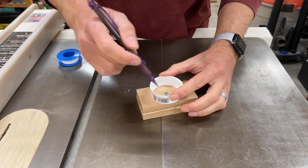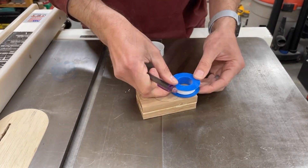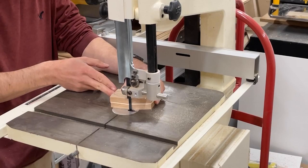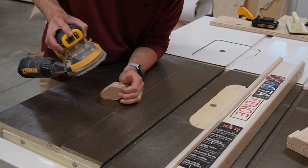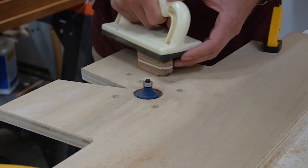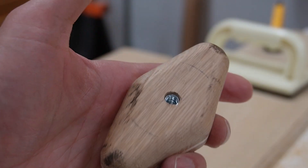To draw the shape of the knob, I grab a nearby roll of Teflon tape and use the container to draw different sized arcs. I connect them with straight lines to create an oblong shape, and then cut things out on the bandsaw, taking my time with small parts and keeping my fingers far from the blade. I smooth out any rough areas left by the bandsaw and then round over the edges on my tiny router table. Because the part is so small, I use a paddle to keep my hands away from the bit. The little bit of burning created is cleaned up with a bit more sanding.